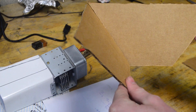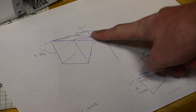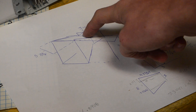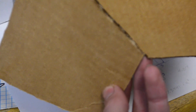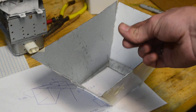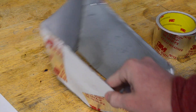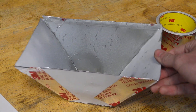Now out of cardboard, I cut these two side templates out. If you want to replicate what I did, here are the dimensions for each of them. And if your magnetron is a different size, you can multiply all the side lengths by the different size ratio. I'm now going to take these and fit them on from the cover of the microwave. Now I have the metal all cut out and roughly put together. I'm going to take this metal enclosure and put some epoxy on it — but for the epoxy to set fully it's going to take about 8 hours. The epoxy finished setting, and after it did I applied these strips of aluminum tape. Not only will these strips of aluminum tape make it so no microwaves can get out, but also they make it quite a bit more strong as the epoxy alone is pretty brittle.